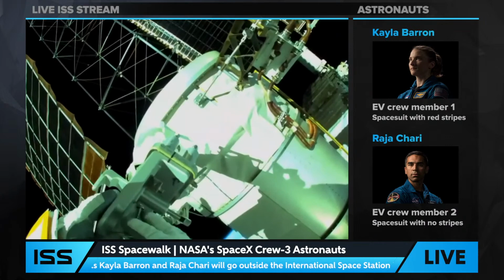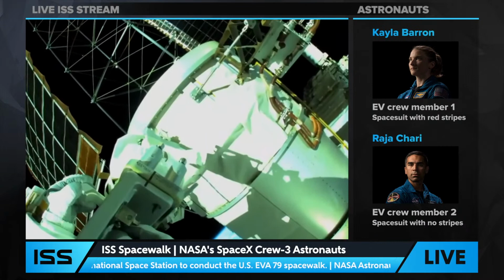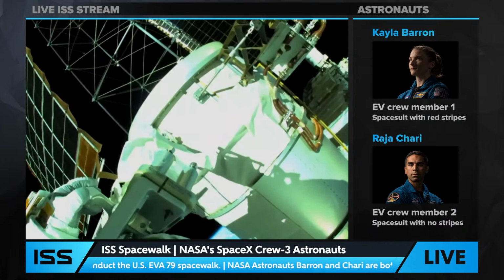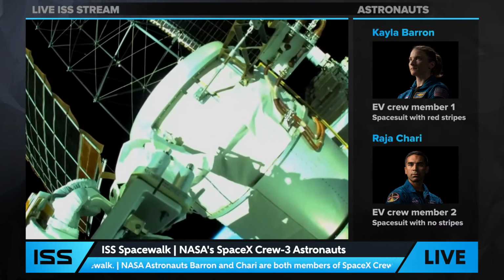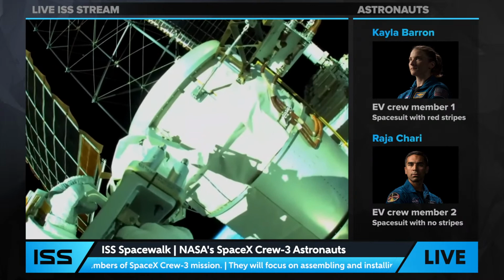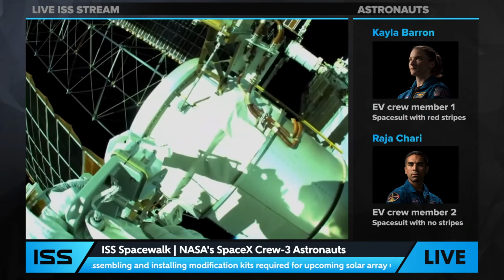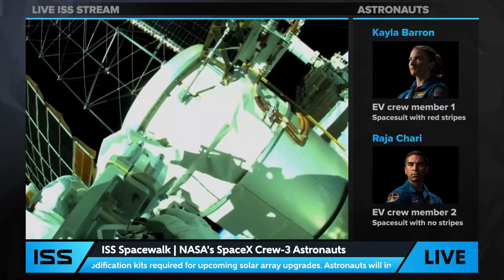All right, and I'm showing 11 turns total, so we may expect more turns on the torque wrench. But we're looking for, again, breaking it over twice. Okay, copy, and maybe three and a half turns on the torque wrench. Complete with a good pull test. Okay, thank you for that. And with the torque wrench, clockwise 60 foot-pounds, we're going to final torque, give us the turns, and looking for that wrench to break over twice.